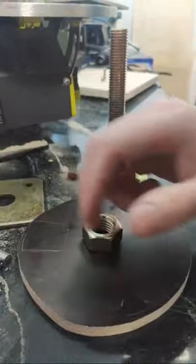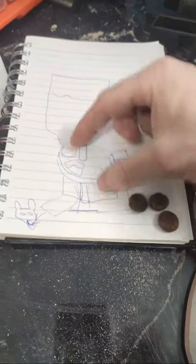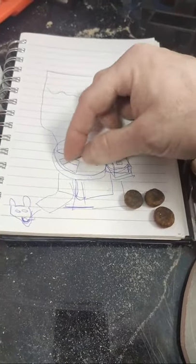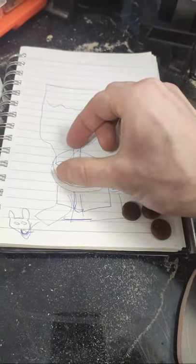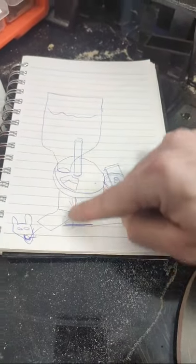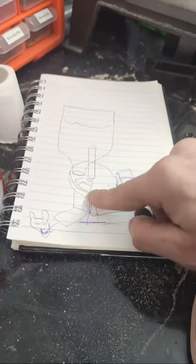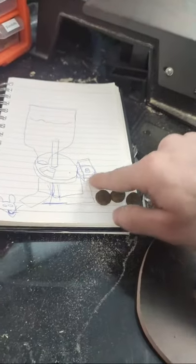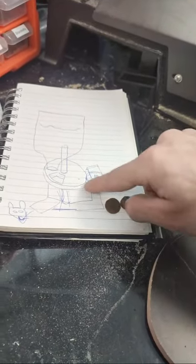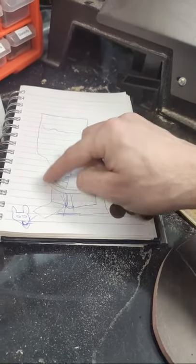For those who just tuned in, this is what we're building here. It's a dog feeder. So it'll be a tank of dog food that'll come down. When it's closed, it's not going through the hole. When it opens up, dog food drops into that volume that's there, and then it turns back and drops what's available. So a few treats per turn, people online will be controlling, and then it goes into the dog's mouth, who are happy. There'll be a servo, which will be here acting on a gear, which will turn this rotation here.